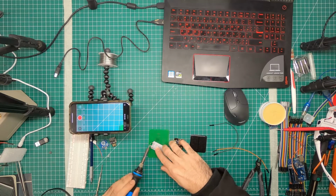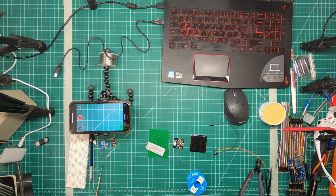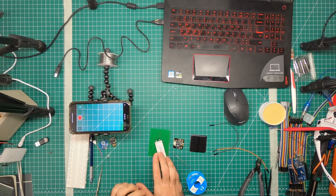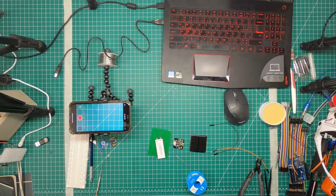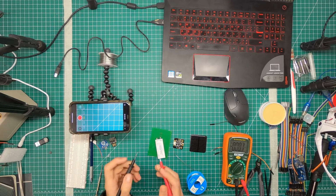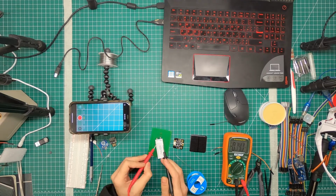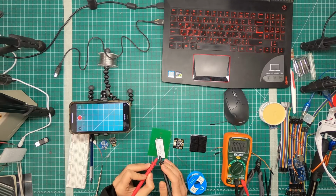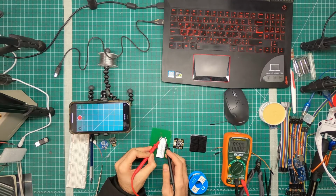Okay, that's a big blob. Once that's done, we want to make sure that our battery still functions. We didn't break anything. Put the voltmeter on volt DC. We're reading a DC voltage. Conventionally, red goes with plus, black goes with minus. Usually these DMMs are smart, so if you flip them, nothing bad is going to happen. So you can see we have 4.1 volts.